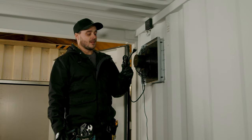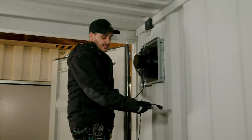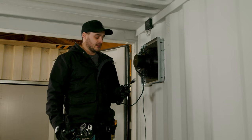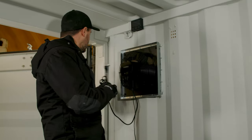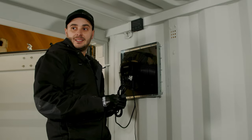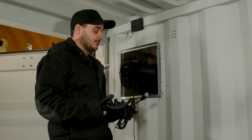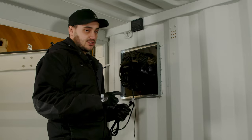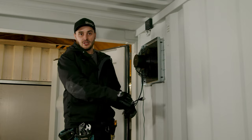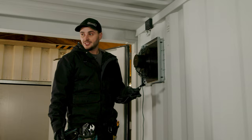One other thing — typically containers are wired and we have electrical in here with a place to plug this in. But in this instance, there's no other wiring going in this container, and the only way to really get power is to run the cord through the door seal. I hate that. So we do have these little dongles for plugging in — like block heaters or for a camper. You drill a two-inch hole, run it through, and then you can plug this in on the inside with a male receptacle on the outside for an extension cord. We should actually get that installed here.